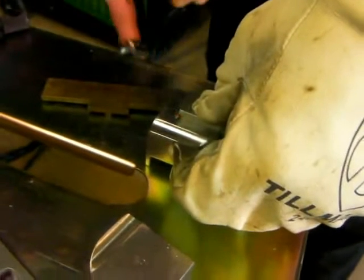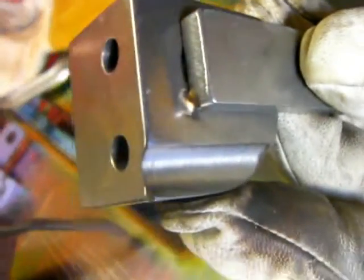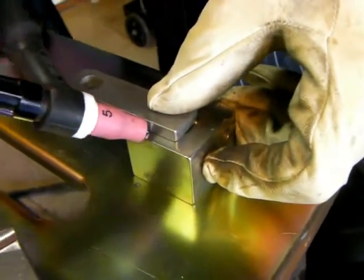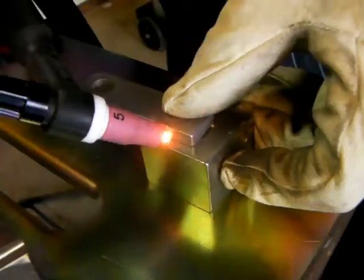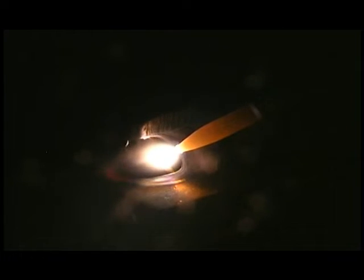I know I'm holding the torch rather close to my thumb here, but I'm being very careful. You have to set the machine on some scrap material so you don't blow corners away, especially if you're doing sheet metal this way. Here's the arc slowed down to one-tenth the speed, tacking it and driving that metal in, tacking the corners. You've got to get some scrap metal and practice, or you'll scrap a few parts, because setting the machine to twice the amperage is riding on the ragged edge — a little risky. But once you get it set on scrap, it sure does speed up tacking when you've got a whole bunch of parts. Just bump the switch as quick on and off as you can.